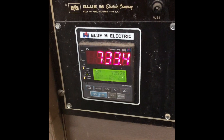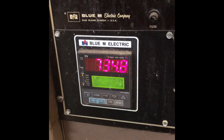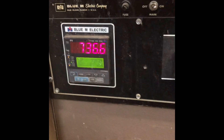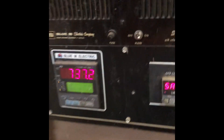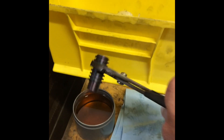After playing with this thing for quite some time and adjusting temperatures, we're finally starting to get the first oven part blue or purple. Had to dial the thermostat up to 725, so the oven's running about 725 to 730. The part finally gotten blue, and my infrared thermometer is telling me the part was at 685 degrees. Let's get that first one out — see, this one's nice and purple, the fins just starting to turn blue. And into the oil it goes.